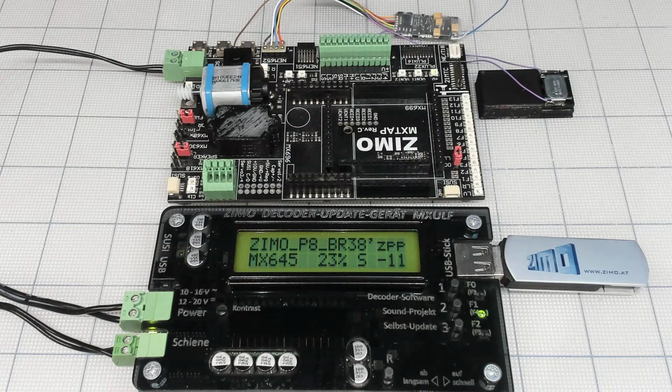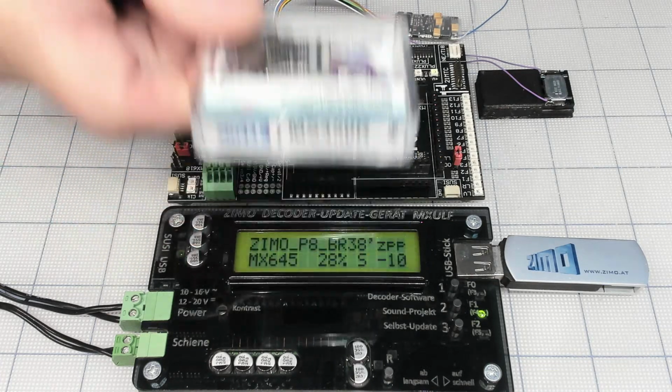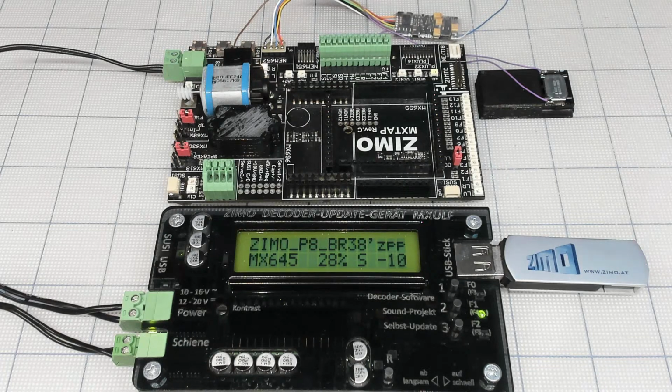It sends the message to the command station, and all buttons will be showing on your throttle, for example, on Marklin command station and ESU. But maybe I'm not lucky, it's always messing with me. It's not the correct buttons, then I need to change buttons, and I'm doing this, guys, a lot. For just a regular user, it's supposed to be easy from the factory when the locomotive has an MFX decoder from Marklin. But when you're doing a scratch project like that, installing a new decoder, it's a little bit tricky.